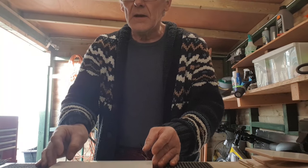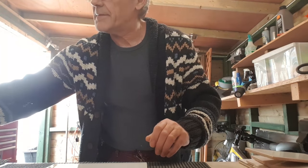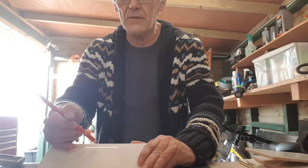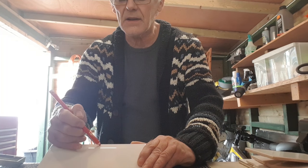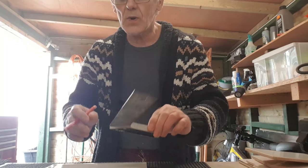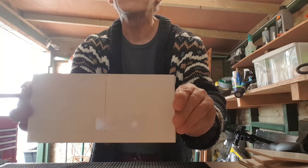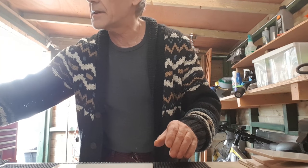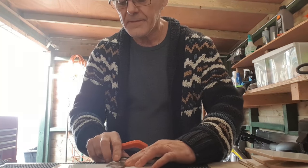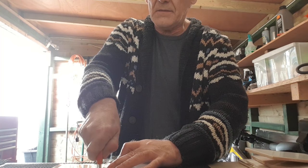Stage one. You've got your tile and you need to cut it. The easiest way to do it — get a tile marker. Get your measurement, so you will have already pre-measured your tile. Use a square, get it nice and square. Mark your tile like so. I've just got a cheap tile scriber — use the square and just make a couple of score marks along the tile.